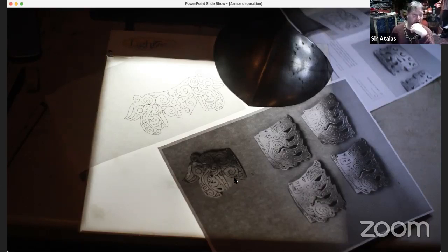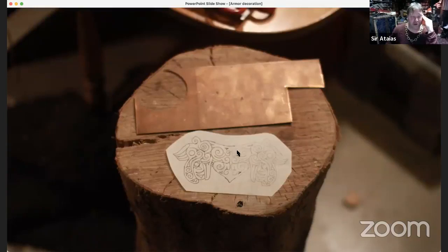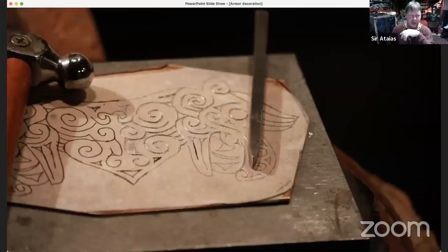So basically I photocopied it, maybe adjusted the contrast or some of the other levels so it stands out. And to make it stand out even more, I might take some very small fine tip Sharpie and go over those lines, so that when I put it onto a transparency on the light board, it stands out more and I can trace over it. And so I did that. And I took the transparency and took some of the Elmer's contact spray glue and applied it to it. And then took a chasing tool and started going along.